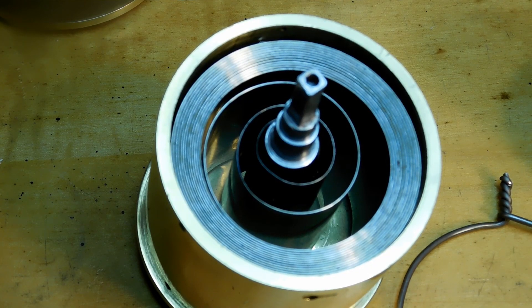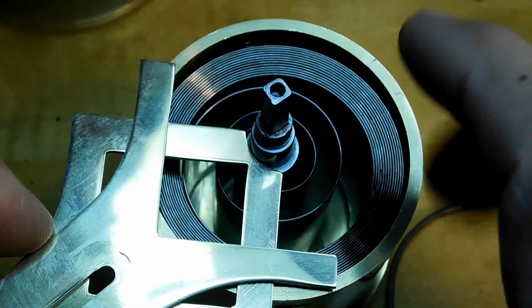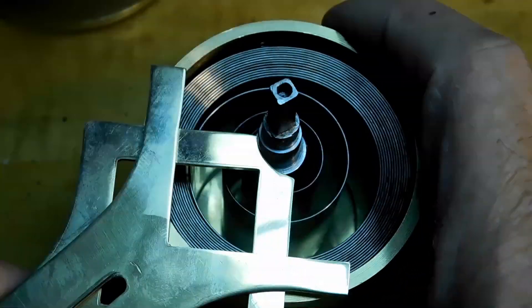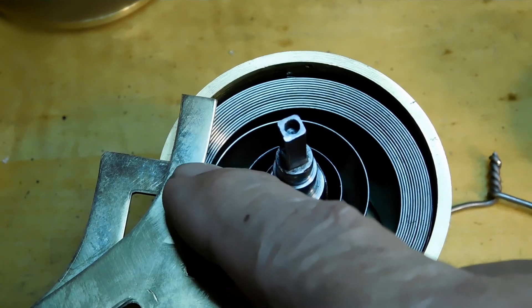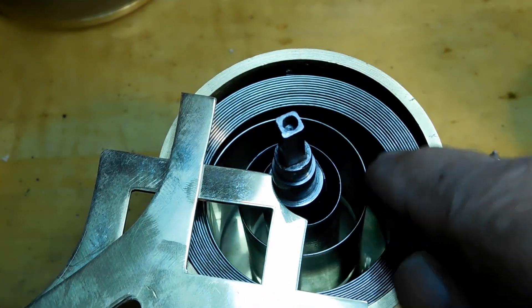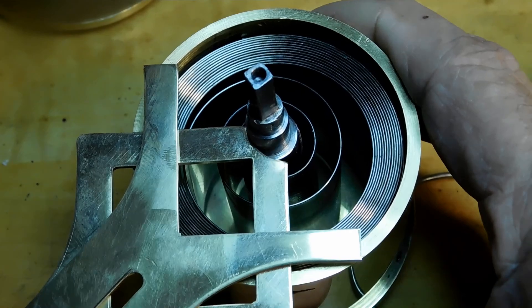There's the mainspring in the barrel. You bring this top part over and put it right up against the arbor, then you slide this top one until it's just inside the barrel at that little hole. Then to the right and to the left, those two angles — this one here and that one there — they want to be just on the edge of the spring. That's how the tool works.